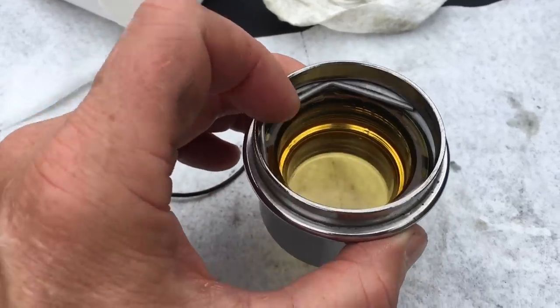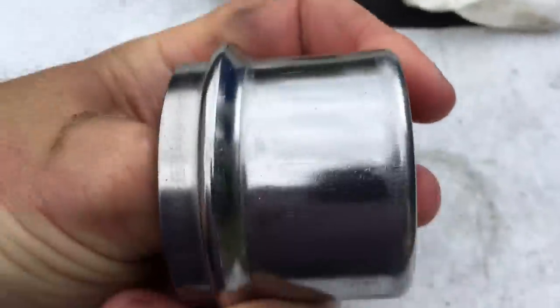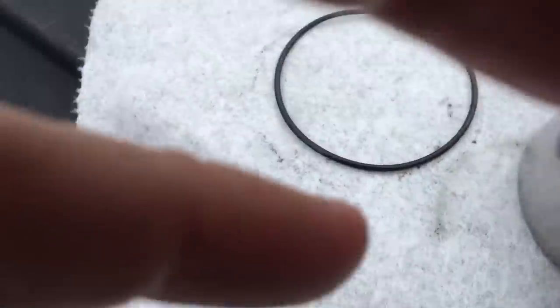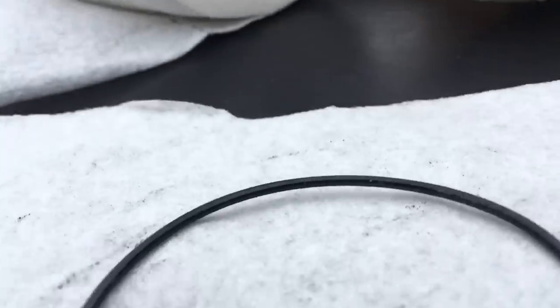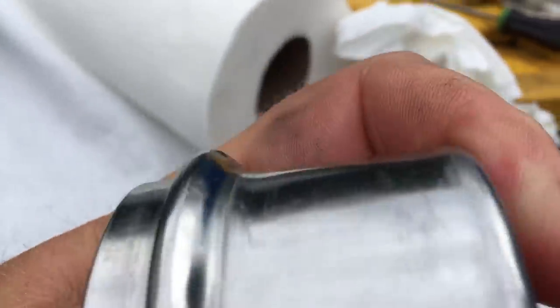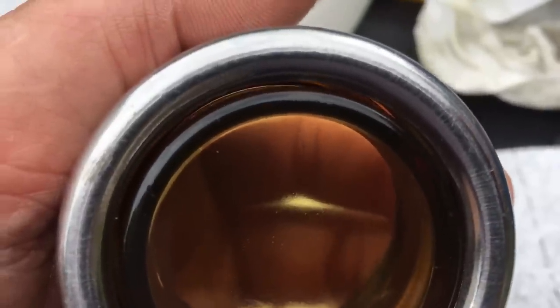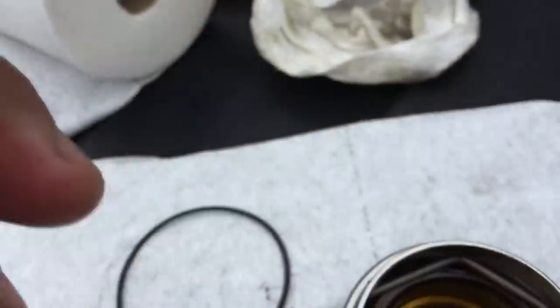You can see the clip — it's nothing complicated — and that holds the spring in place. This is how it actually works: as pressure builds inside the cavity it pushes out. The idea is that as pressure builds inside the cavity, it pushes out, and the o-rings around the outside inside that cavity seal the oil inside. That's why grit can be a cause of failure — it gets between those o-rings, the oil leaks out, there's no lubricant, and then the more that leaks out the worse it gets due to air expansion.